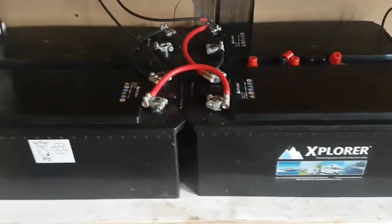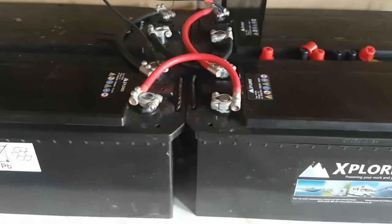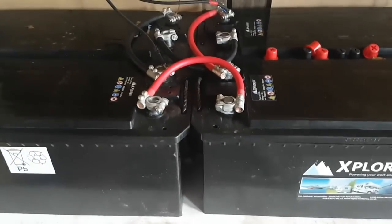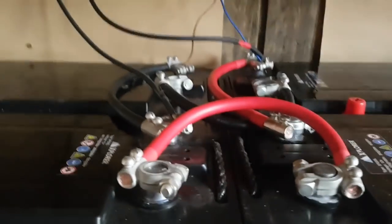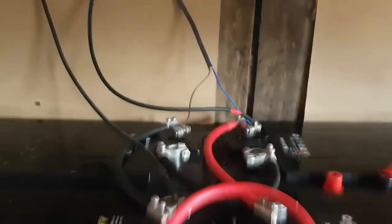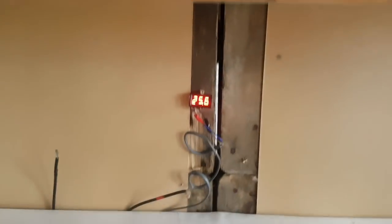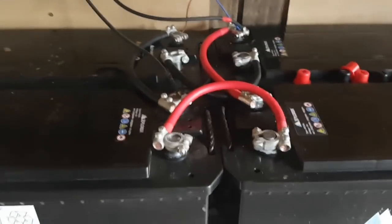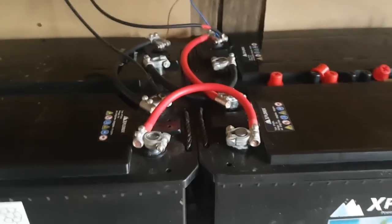Here's the battery pack I've gone for. It's four of these 220 amp-hour lead acids, sealed — so minimum maintenance, just a bit of dusting. I've got these wired in series and parallel, so I've got 440 amp-hours at 24 volts. At the minute they've just come with their standard charge, so as you can see it's at 25.6 volts. You need to get these hooked up before you can hook together any of the rest of your system, because all the charge controllers need to get the voltage they operate at from the batteries.